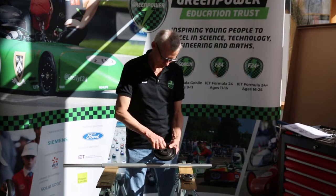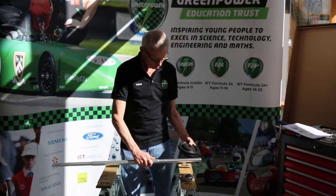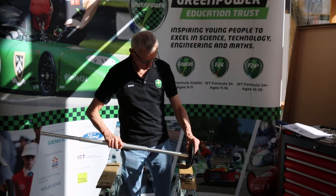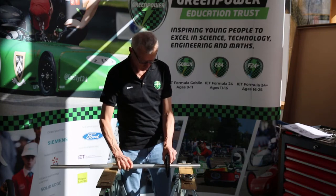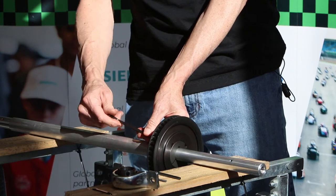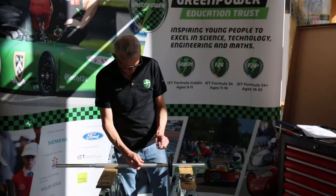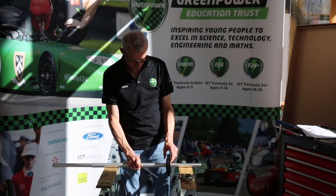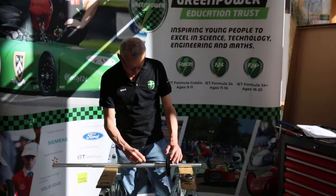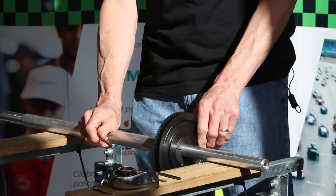They will go in a long way, and then we're going to apply that onto our axle — it needs to be done so that those Allen keys face the center of the axle. So we're going to go in this way and slide it onto the axle. I'm just going to do those screws up a little bit more. I'm not making this tight, but at some point as that goes on it will mean that the bush clamps the whole of this assembly onto the axle and stops it rotating. Just tweak those up enough so that those two items don't come apart but it still rotates on the axle.